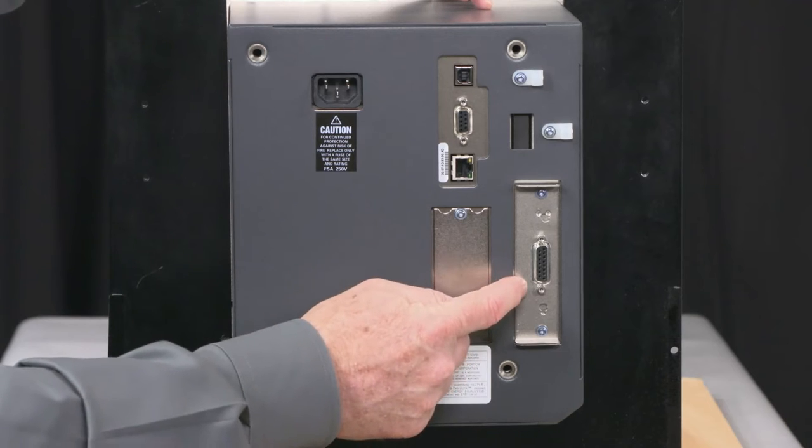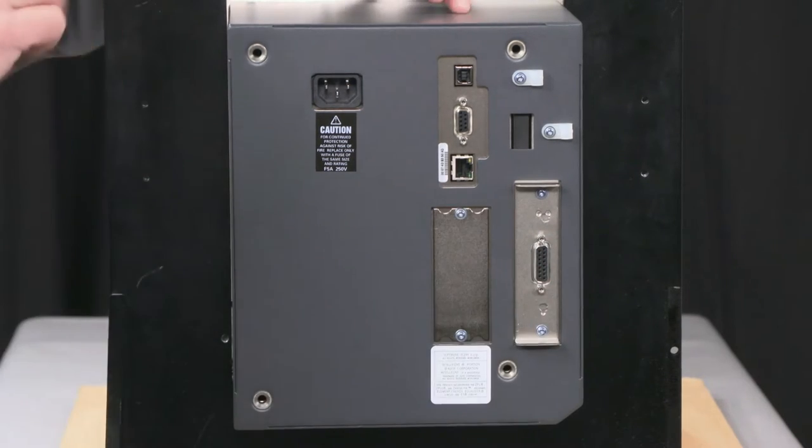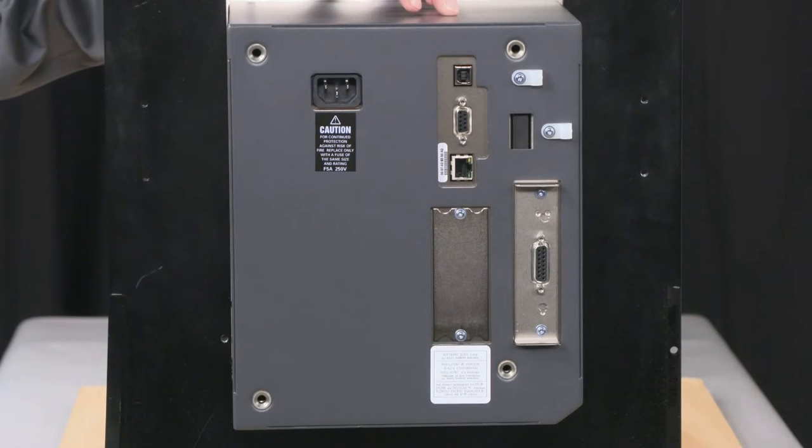You have your I/O card. The I/O card slides out for easy change. Move two jumpers, send a simple command to the device. You can change it from zero volts — if you provide voltage yourself out of your device — to five volts to twenty-four volts. It's galvanically isolated and designed to fold back on itself.